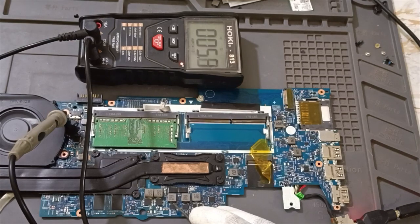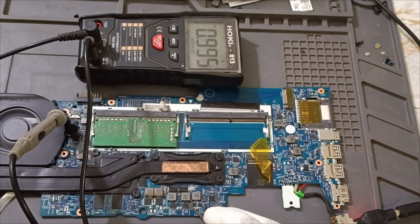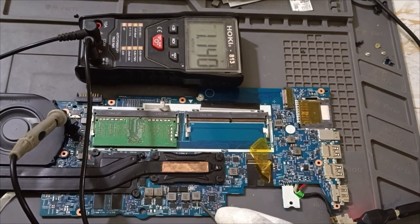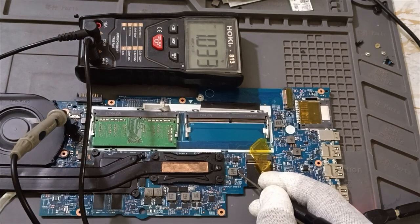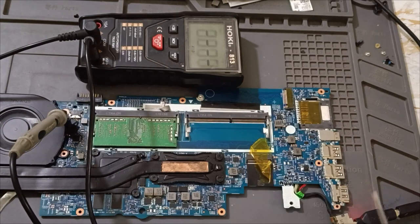See, this also we are getting. This one we are not getting. Okay. This one, 0.9. Okay, we are getting. We don't know exactly which one it is. This one we are getting. Okay. This is actually CPU core IC, and here one more is there, 1 volts. Okay, this belongs to this, I think so, but anyway, let me check one by one.